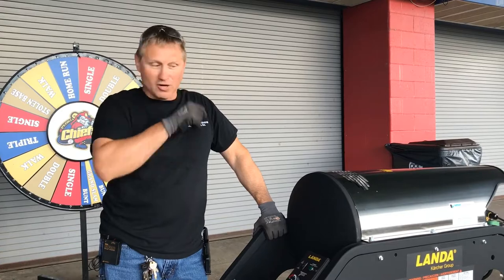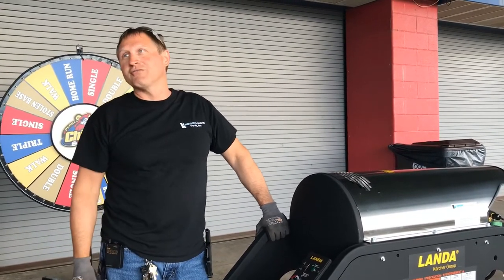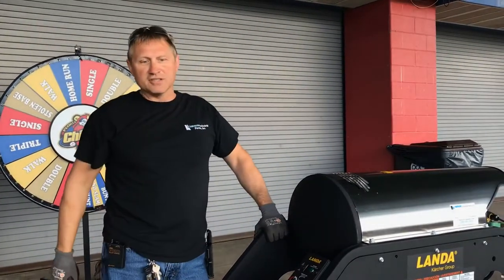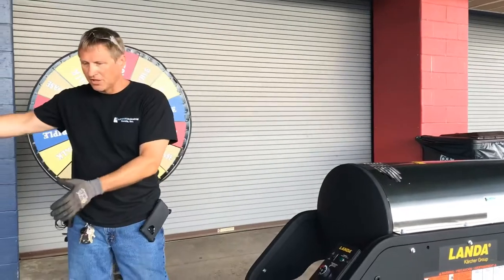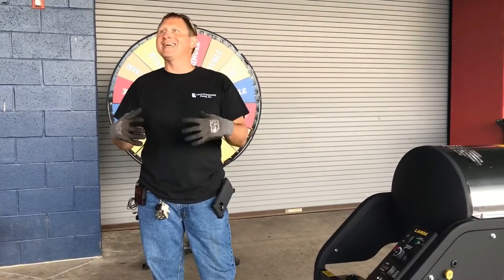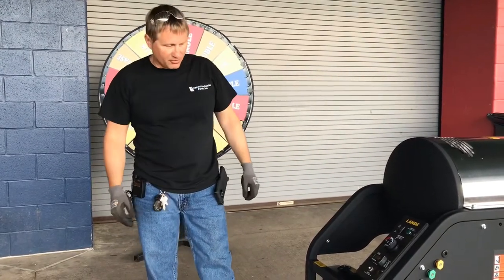The pressure from the pressure washer, which is a 3 gallon at 3,000, is going to do most of the work for you. For your bigger areas, the surface cleaner will do your best because you'll be able to just cover that area and go back and forth. Areas that are tight and against the corners where you can't get inside, that's where the turbo nozzle will just rip and tear, and so we'll demonstrate both of those.